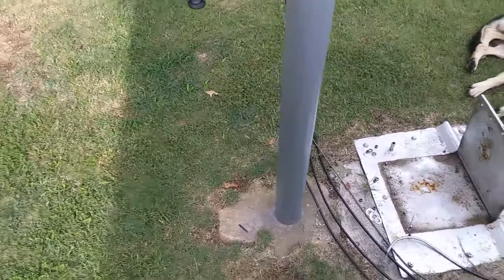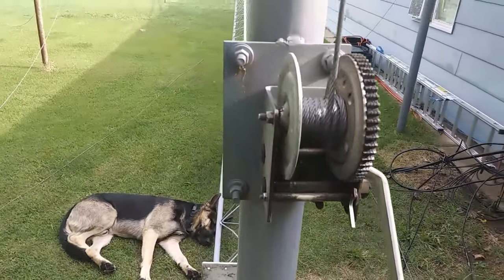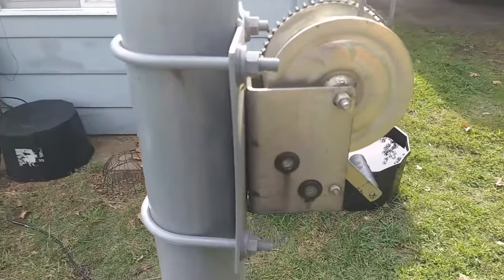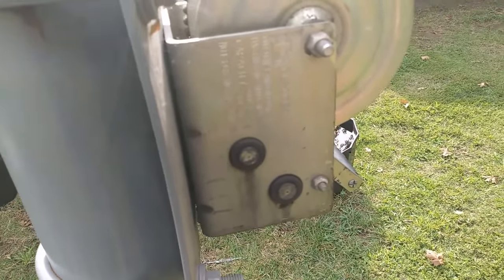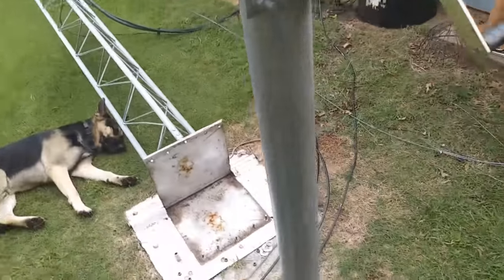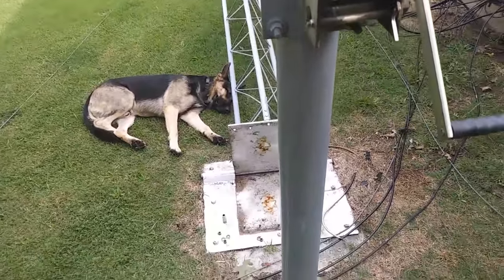It's originally a four-and-a-half-inch by 24-foot piece of pipe, with four feet in the ground. This is a 2,000-pound boat winch that came without cable, so I went to the local hardware store and bought some quarter-inch aircraft cable. This is a Dutton DL-2000 winch — works great. I've got it bolted and tack-welded on the side of the pole. Eventually I'm going to take this off and put an electric 12-volt 9,000-pound Jeep winch on here.